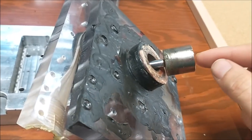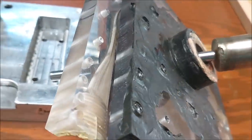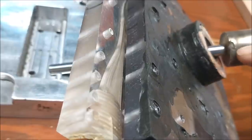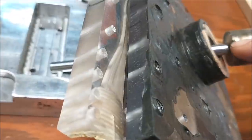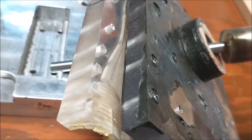When you're dealing with these magnets, you want to make sure that you don't smack them on metal. If you're really careful, you won't end up with this little nick. I didn't know the nick was there because there's a coating around the magnet — it's a nickel coating. When I hit the magnet on the metal, it made a chip, but I didn't know the chip was there because of the coating. At really high speeds, the little chipped piece of magnet flew off.